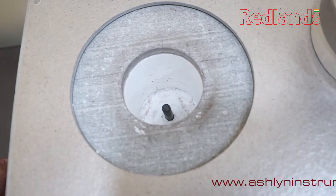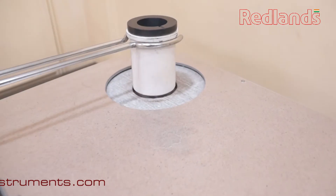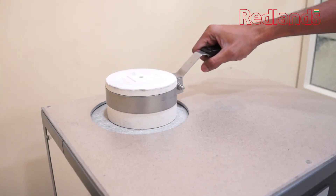The underlay should be lined with insulation former, and the temperature sensor should touch the bottom hole of the crucible. Check the wear and tear condition of the insulation former before inserting the crucible.